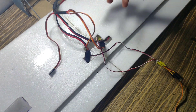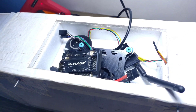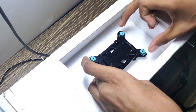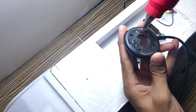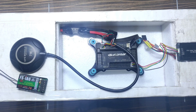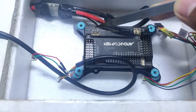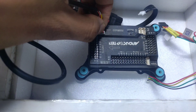I did the same thing for the servos as well. Now let's move on towards the fuselage. As you can see, I've already installed the servos for the elevator and rudder, and made a little compartment for the flight controller and the rest of the electronics. Everything is neatly arranged. Now it's time to connect all this stuff. As you can see there are so many ports on this flight controller board — this one is for the GPS, another port is for the compass, this port is for the telemetry, and that one is for the power module.